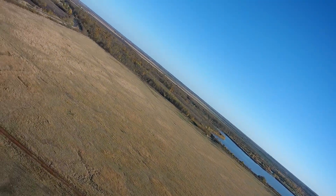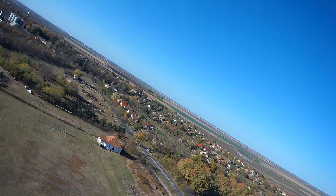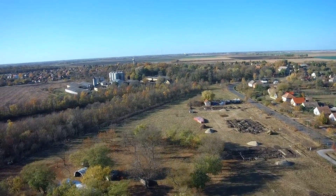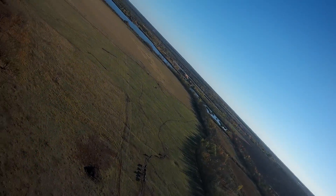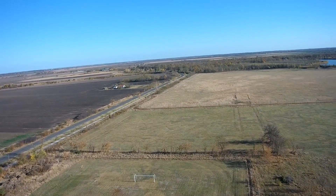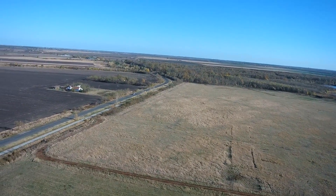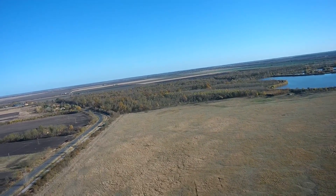Connected on this Nano Talon is the Hawkeye Firefly 8SE action camera, which I'm really finding myself reaching for quite often. For the internal FPV setup I went with the Hawkeye Firefly Fortress — it's a 31-dollar combo that takes a very small footprint and gets me a minimum of one kilometer of range, which is remarkable for its tiny size. The VTX runs on 5 volts and broadcasts up to 200 milliwatts. I got really good range with a perfect video feed the whole time, though there were occasional lines appearing and disappearing — I believe that's a software sync issue rather than noise.